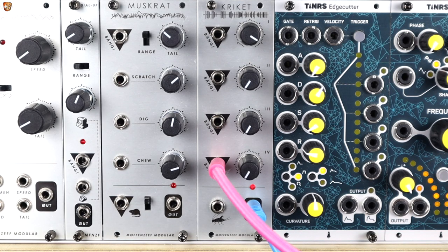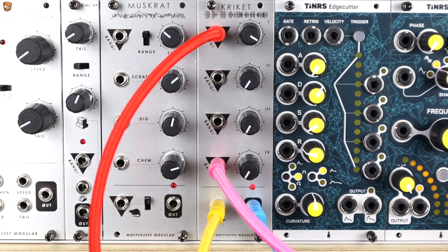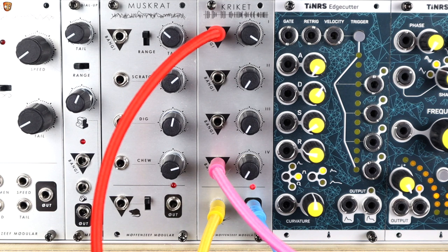Here's sequencing Cricket like a standard oscillator — my gate pattern is into the bang, and let's add a volt-per-octave pitch sequence. It's of course not a standard oscillator, and that Vactrol-based pitch control, the cricket input, is definitely not going to track anything like a volt per octave. Let's add a short trigger to one of the other channels just to get a little pulsing percussive feel through this. Certainly not volt per octave, but weird and sequenced. You could use an analog sequencer and carefully fine-tune these pitch movements if you wish, but just think of it as a demented group of crickets — it's more fun that way.